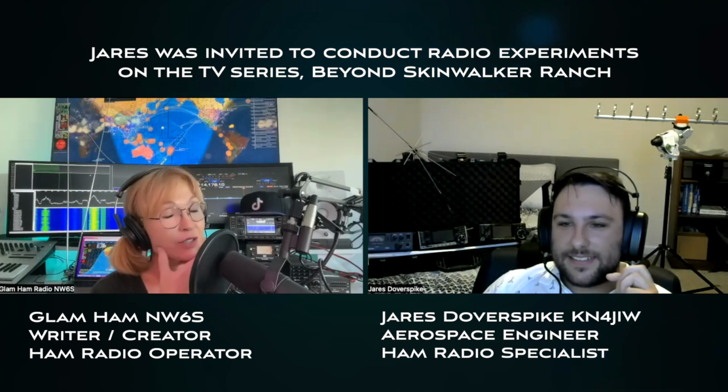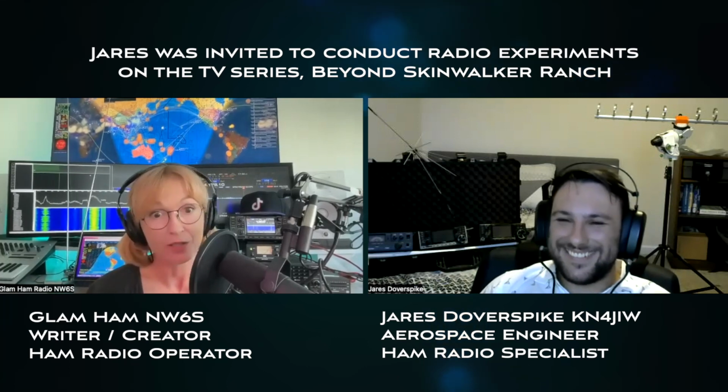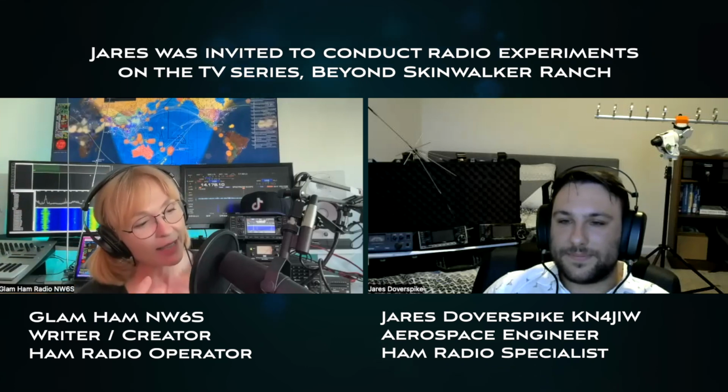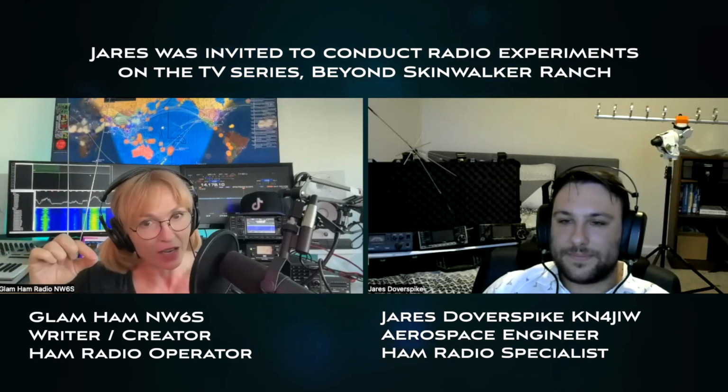Because my big harmonic thing that I looked into, of course, is this notorious Baofeng UV5R that's famous for the spurious emissions. And I'm always drawing pictures of it in my life. I draw the line, the spike, and then more spikes to show the spurious emissions. But I had thought that if there's a spike, it also will go on the other side. So in essence, if this is the main frequency, you'll get them going like this, but you're saying that's not the case.